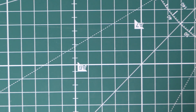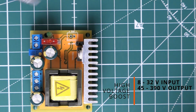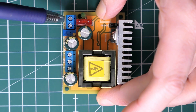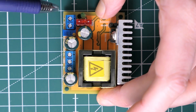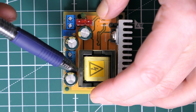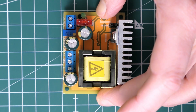The last thing I'll show you is this high voltage boost converter. Unlike the buck-boost converter, this only generates voltages higher than what you put in. The input side can take up to 40 volts, and the output can go up to almost 400 volts — around 390 volts at 200 milliamps. That is quite a lot of DC voltage; it could certainly give you a very bad shock, maybe even a fatal one. So be extremely careful. If you have an application requiring 100 or 200 volts, this is what you need — but use it with real caution.